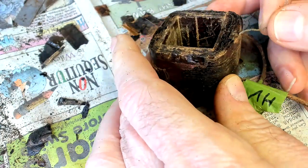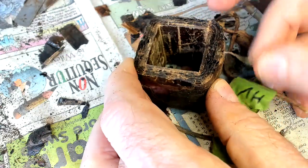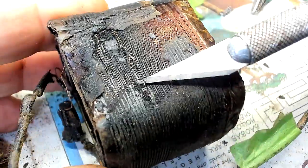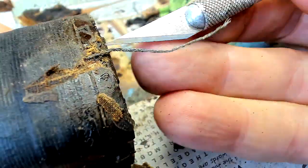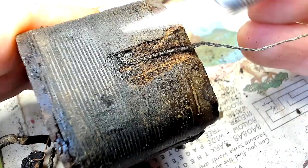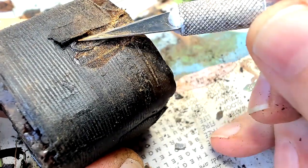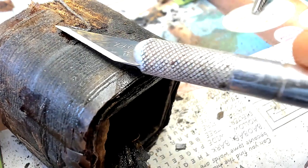I'd like to figure out where this thing is. What's this got to do with this? What do you think this ground wire is connected to? Here's the high voltage wires, all frizzled. They're just baked. So where is this ground wire connected to? Because we were getting continuity between this ground wire and one of the legs of the high voltage. We're getting 400 ohms.